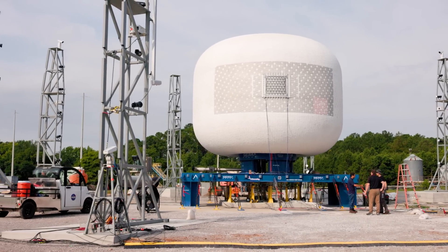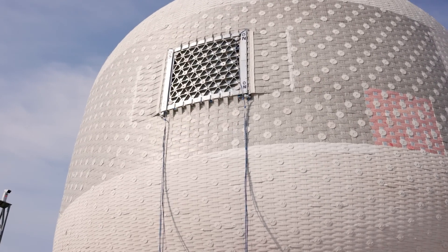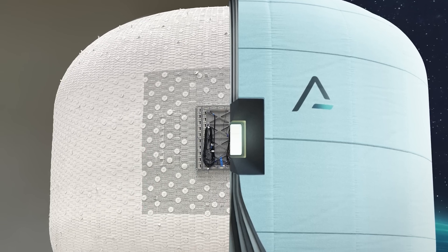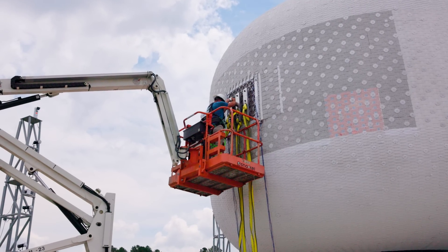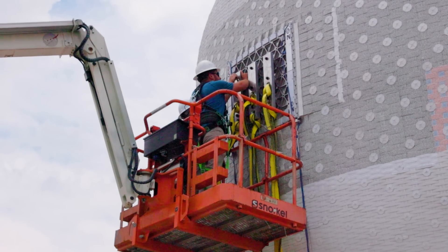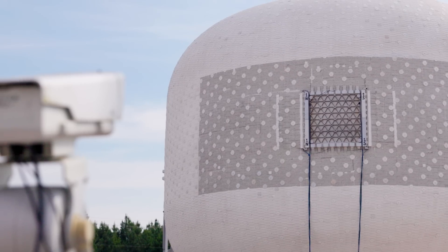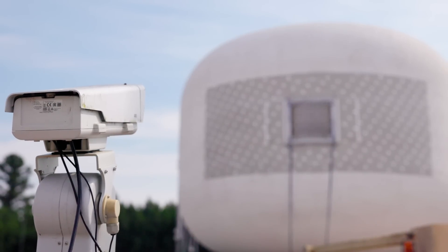How this test differs from the last test is in a few ways. One of the most apparent and obvious ways is in the blanking plate. This has a different metallic blanking plate interface compared to what we did in December. This interface allows us a great opportunity to expand and have a larger window. For this test in particular, some of the things we're looking for are those tricky spots where hard goods meet soft goods. Those blanking plates are made of metal and then we have webbing next to it — those spots of interaction are really important and we have a lot of sensors there to understand what's happening.